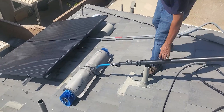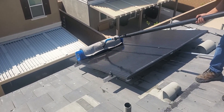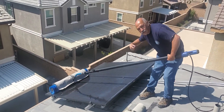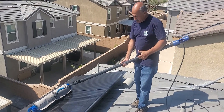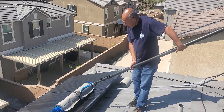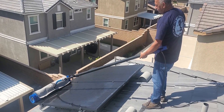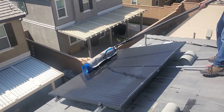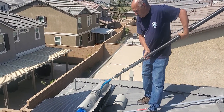For example, if we're looking at the brush position and we're all the way at the edge and we're forward like this, that basically goes over — and if it goes over, you're probably going to go with it. So you always want to work straight up, back and forth. Your hand motion: back, and if you want to get the edge, hit it at the edge for a slight bit, slide it across and then back, but your body is straight up the whole time.